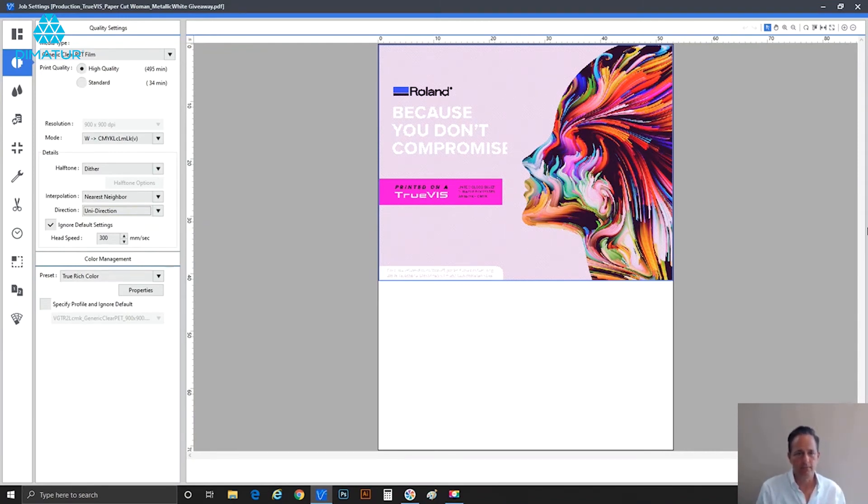The way polymer migration shows up, especially with a white ink printer, is crazing — the shelf life has gone too long, you expect a solid field of white, but it looks like old paint that's cracked open and created ridges and valleys. It's not attractive. Always refer to manufacturer specifications. Materials have a lot number stamped on them indicating when they were manufactured, and you need to track when shelf life expires — check the manufacturer's website for each material's shelf life.